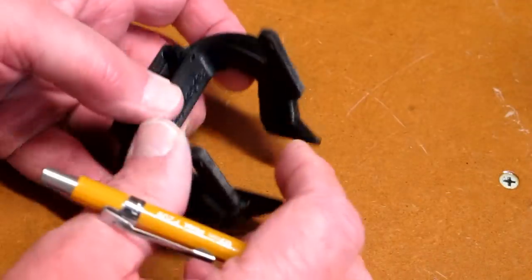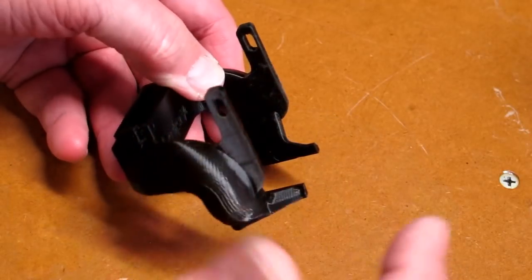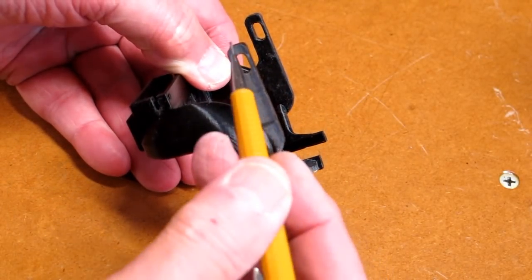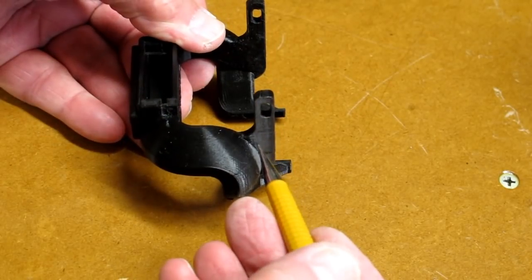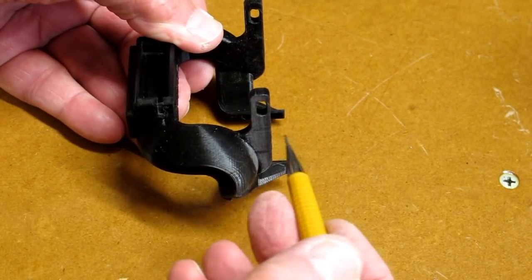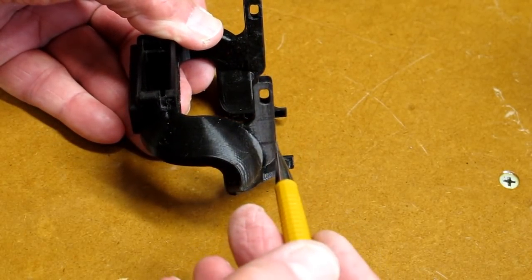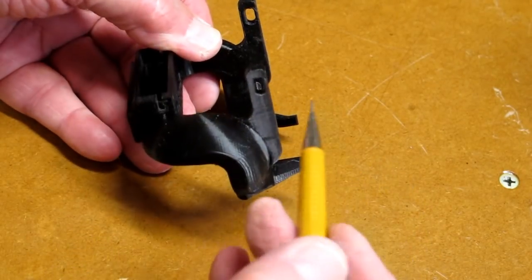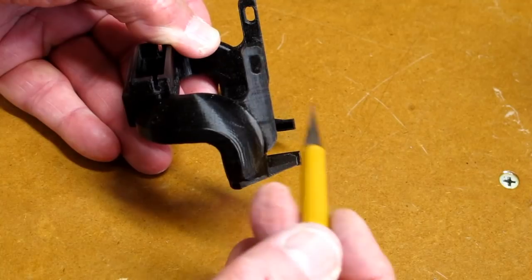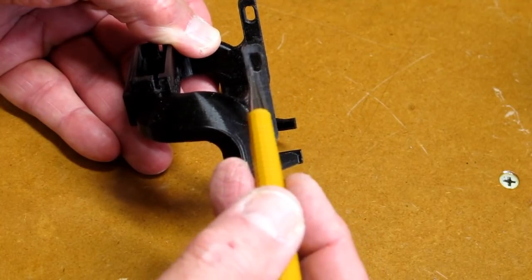The Bullseye cooling system is very good, but it does have one weakness and that's in these mounting or support arms. This is printed in this configuration and there's nothing but laminations in through here. If you bump this into something or drop this, it very quickly snaps off right here or in through here.